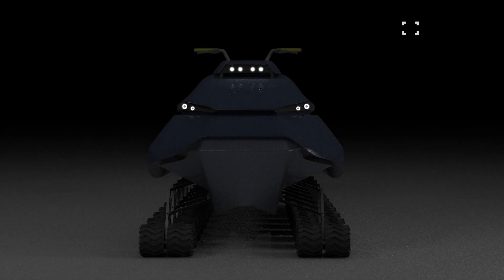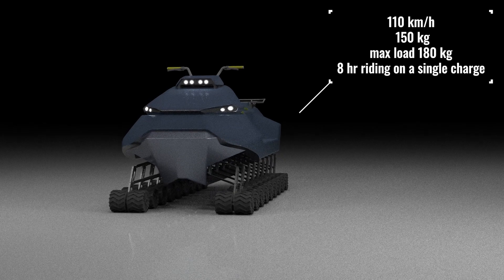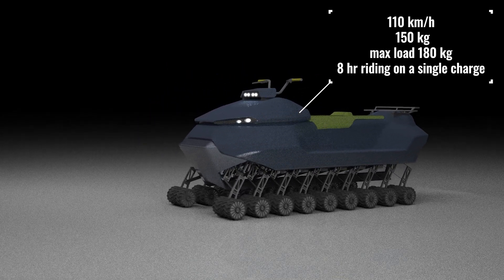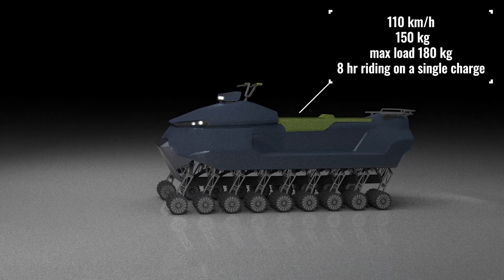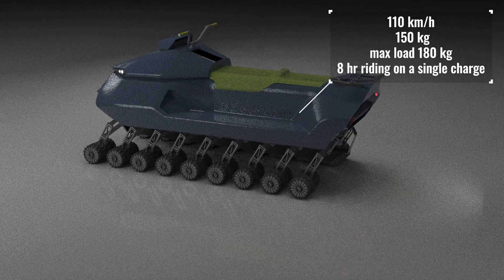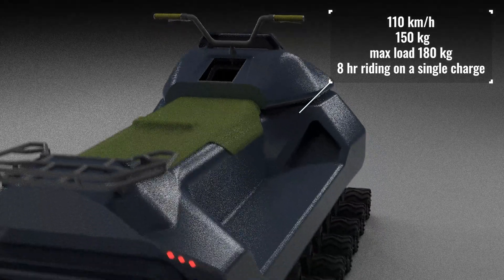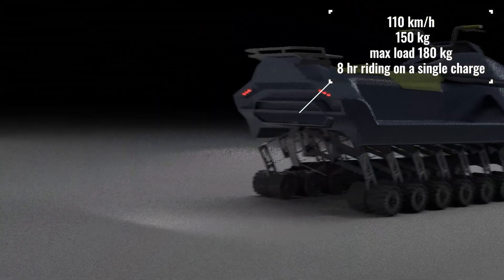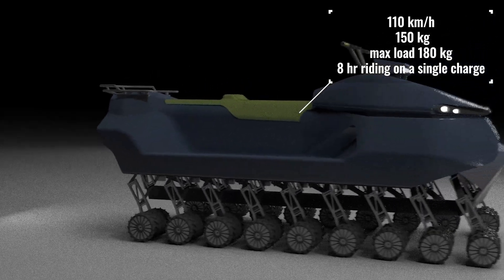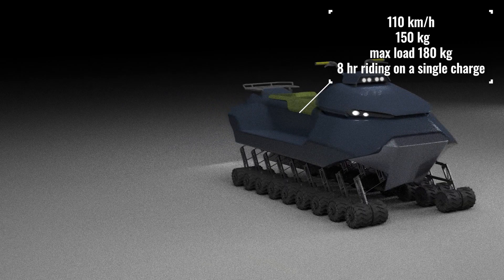So, what is the innovation of our solution? We have minimized unsprung weight as much as possible by using 18 lightweight polyurethane wheels with lightweight electric motors inside, and by eliminating any other elements that could affect the mass — the suspension system is attached directly to the wheel axle without any additional elements, braking system, or transmission. If the unsprung weight of a normal ATV is approximately 25 to 30 kilograms, our design is only 2.2 kilograms.